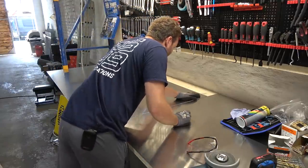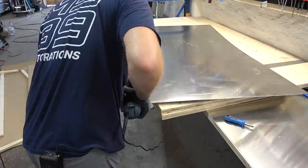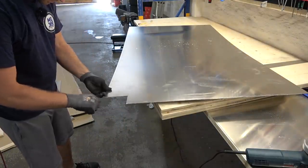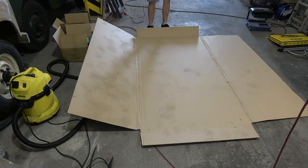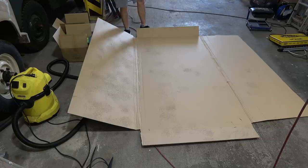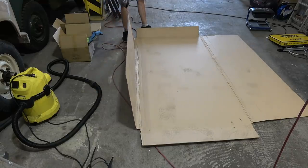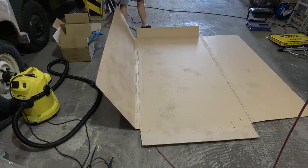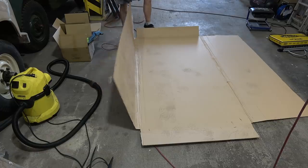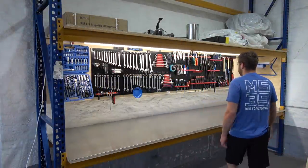I can't cut myself on the edge — that's kind of important — and all of the edges are not sharp, so it's user-friendly. To secure it I'm just going to drill a bit bigger hole and then self-tap it. I created a little valley where the self-tapper can go so it sits flush with the table — nothing is sticking out. That is nice and flush with the table surface. Perfect, nice and flat — that's one plate in place. I had to go home and shower — I had metal shavings in my earlobes and everywhere.